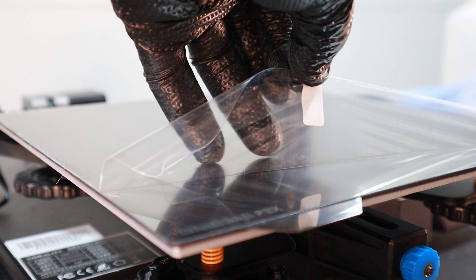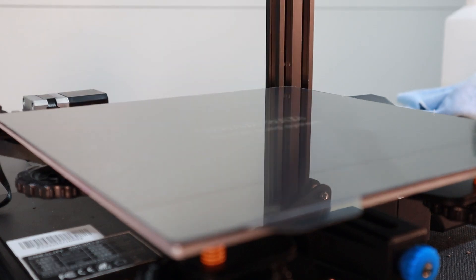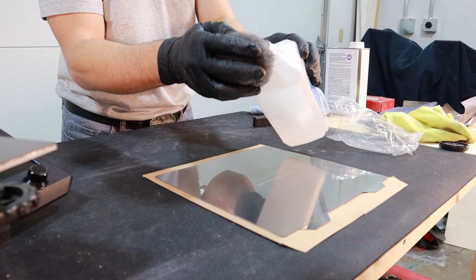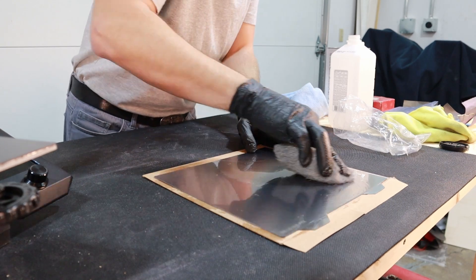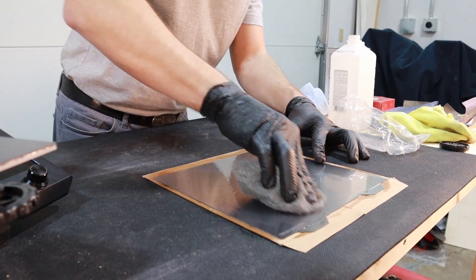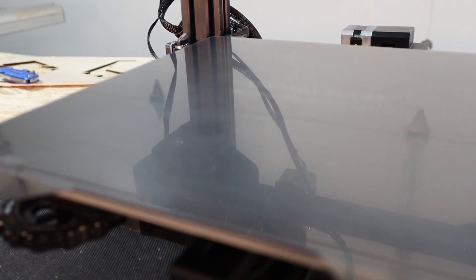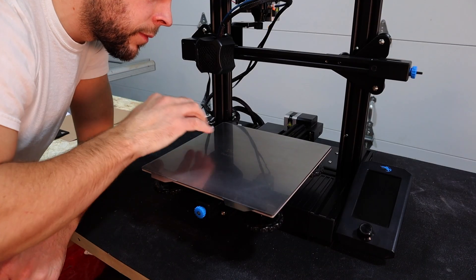It is time to peel off that protection and see what we have. Oh, that is just beautiful. Now we have to prep the surface — they provided triple-aught steel wool, and if you've ever worked with steel wool before you'll know that it makes a big mess of steel fibers everywhere. It's a good idea to keep this step away from your 3D printer. We need to take that steel wool and some alcohol and scuff up the surface a little bit, then a good clean afterward and we're ready to try and level the bed. But full adhesion doesn't come until about 72 hours after application, so I'm going to have to wait a little bit and come back.